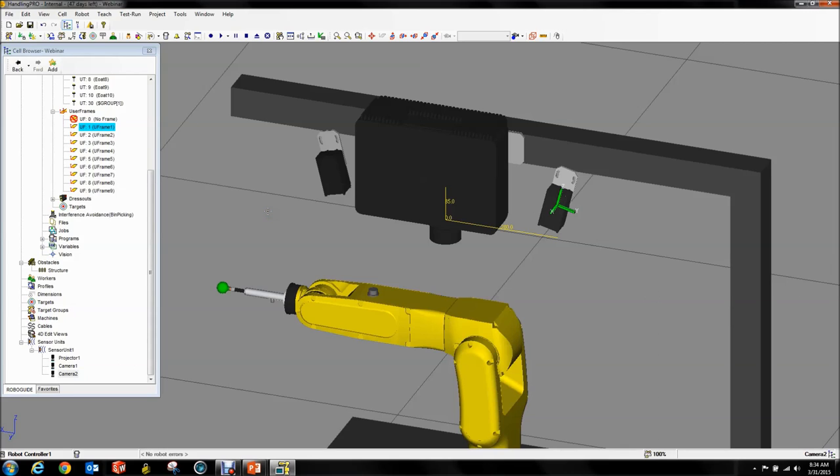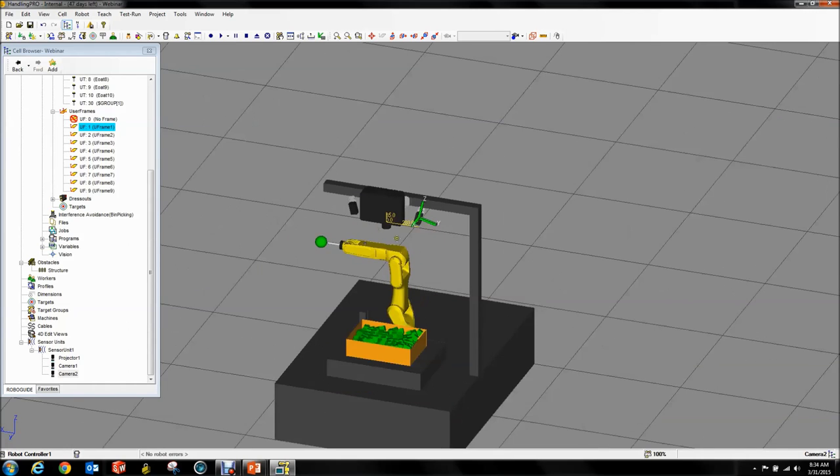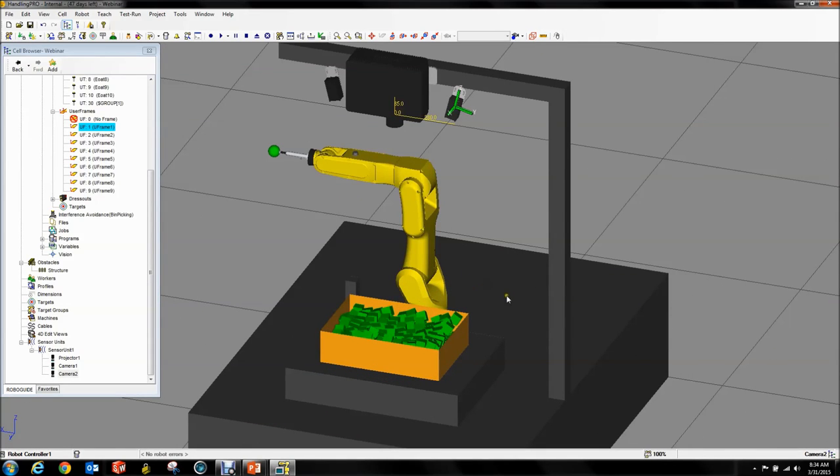If you do this in the real world, you should use Robot Generated Grid Calibration — I'll have to defer you to the manual for that because it's more extensive and we're not going to cover it in the video. The robot generated grid calibration works much better with cameras that are on an angle, potentially high up, with a large field of view and possible obstructions where you can't reliably put down a grid. And as a side note: if you ever have the choice between grid calibration and robot generated grid calibration, go with the robot generated — it's far superior, though a little more tedious to set up.